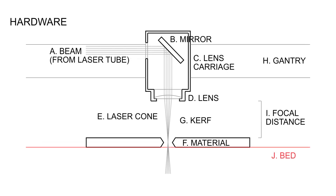A couple things to note here. You will see in this diagram that material is removed — it's actually vaporized, meaning instead of cutting where we have like sawdust, we break the material down to tiny particles and oftentimes down to the chemicals that make up the material. We call that gap the kerf and while it's incredibly small and often negligible for most applications, there is material removed. Generally it's like 0.2 to 0.3 millimeters — think of a mechanical pencil with a very fine lead. It's smaller than that.